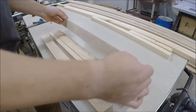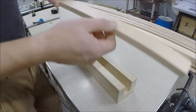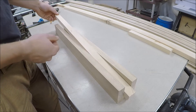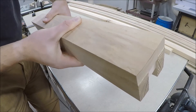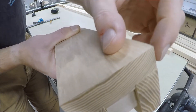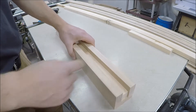We'll cut the biscuit holes. This will get assembled in here like that, and this one will go like this as best we can. I used some scrap pine to make a filler piece that will sit and be glued in. So this now becomes one solid unit. If I flip it over, you can imagine that being cut in the miter saw — there's the profile of your railing. This is solid. We'll route out the finger rails there and smooth the top and bottom edges, so that's what it will look like.